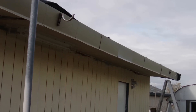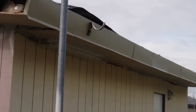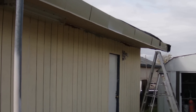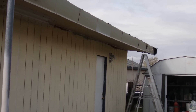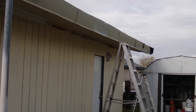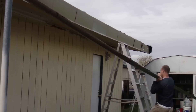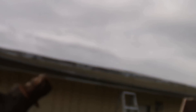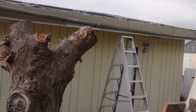I've snapped an angled line which drops about 4 inches over 26 feet from end to end, and hung two gutter hangers that will hold the gutter up there for a one-man hang before I screw it in. Put the ladder into the center of the garage, find the center of the gutter, and lift it onto the hangers. You'll notice there's a bit of a bow in that, and you can just correct that with screws — or put another hanger.